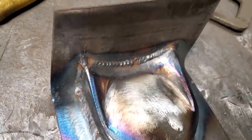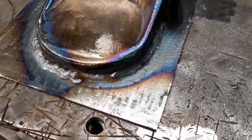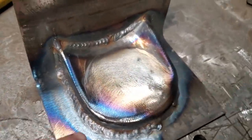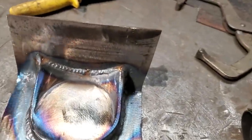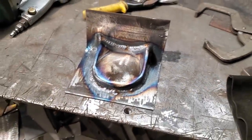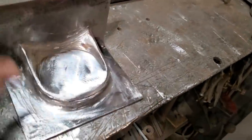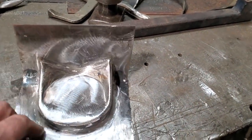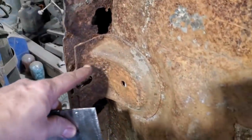There it is, fully welded on. I'm going to grind and dress that up now, make it look pretty. So I've got that all welded up all the way around, all grinded up and dressed up. Now the last thing I've got to put in it is this dimple. This tapers off and goes right down here, so what I'm going to do to accommodate that is cut a relief in through here so this can open out, and then I'll re-weld it in here.